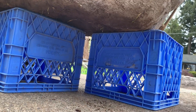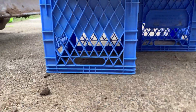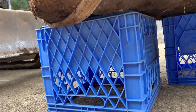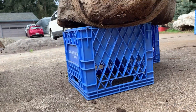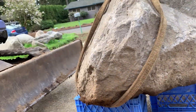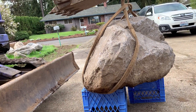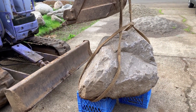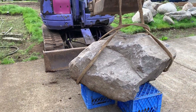I can't find any more damage in here — I don't see any. This is the weakest configuration you'll find. If you put this in an excavation and backfill it so it's nice and compacted, it's going to perform even better. And if you use milk crates that aren't already broken, even better still. Two milk crates supporting somewhere between 1,500 and 2,000 pounds. I looked it up again and it's actually closer to 180 or 190 pounds per cubic foot for basalt. So this stuff is heavy.